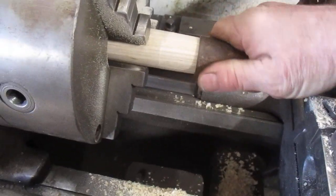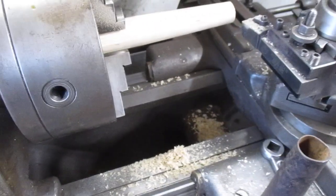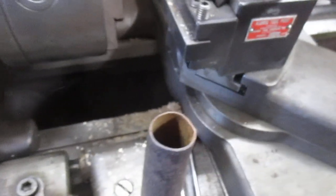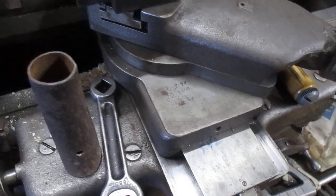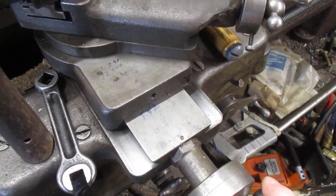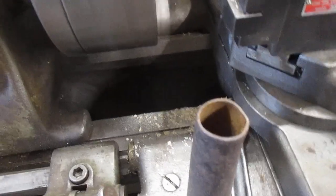This thing isn't round but what I got now is pretty round, so it's going to have to take a couple more cuts. I think I was at 50 on the last one, so we'll come back up here. Roll this back up, roll that in - see what I'm at here, 50. So I'll go to 55, turn it back on. I think I'll go to 60, so I'm taking 20 thousandths off of it.